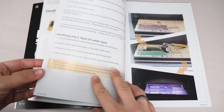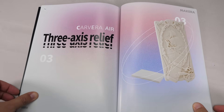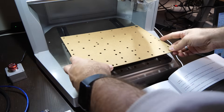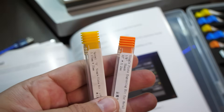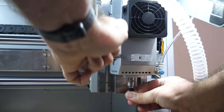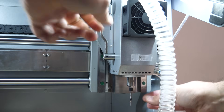The machine includes a few sample projects. There's an LED light where you can machine the PCB, the base, even the switch, but that would take too long to demo. There's also a 3-axis relief project using epoxy tooling board, so let's try that one. First we secure the wasteboard and the epoxy board on the table with the included brackets and clamps. We used two bits for this project, marked as 1 and 2 — handle them carefully, the second has a protective sleeve for a reason. Changing tools is very straightforward: pull the big lever on the side, the bit pops out, insert the new one, release the lever, done.